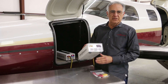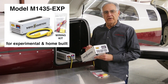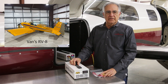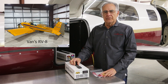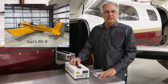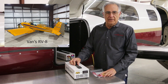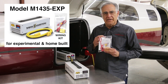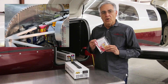There's also a special version of our mini GPU designed specifically for experimental amateur-built aircraft. Unlike production aircraft, home builds typically do not have an external power receptacle for a GPU, so there's no convenient way to power the airframe in the hangar without either using the ship's battery, which tends to be small, or attaching jumper cables to the battery. Our EXP model includes a simple wiring kit and instructions to install an aviation-grade external power plug on your home-built.